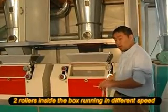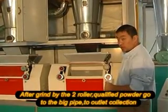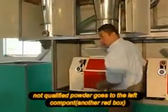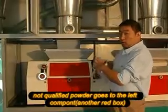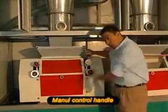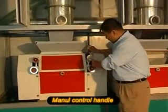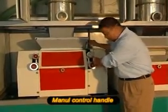The not-qualified wood powder will flow down from here to here. There will be two rollers running at different speeds to grind it. If it reaches 100 mesh, it will go up from behind this part and also go to the end product. If it has not reached the required mesh, it will go up to part 2. This part uses the same structure as the previous one and will re-grind the wood powders to reach our qualifications. There is also a mobile component here — it can be run by hand. When you start running the machine, you can operate it by hand, and if you want to stop it, just pull it back.